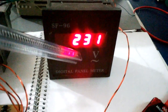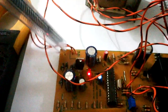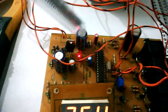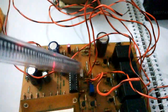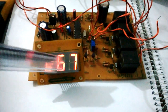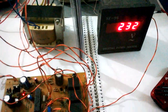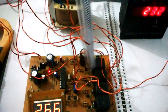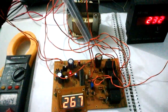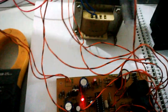This blue set of wires provides the auxiliary supply for the circuitry from the transformer tapping. It is rectified and filtered, then regulated with a 7805 regulator to provide a constant five volt supply to operate the microcontroller and the seven segment display. The input voltage is sensed by the microcontroller by converting the AC mains to DC using four diodes acting as a bridge rectifier, filtering with a bulk capacitor, and then stepping that down with a voltage divider circuit using multiple series resistors to reduce power dissipation per resistor.